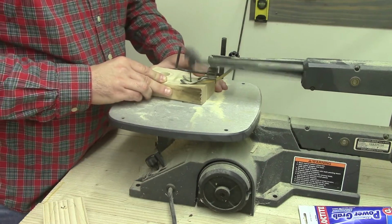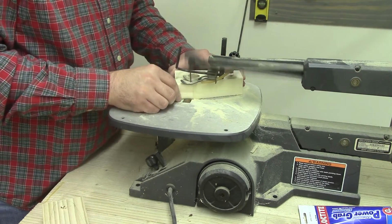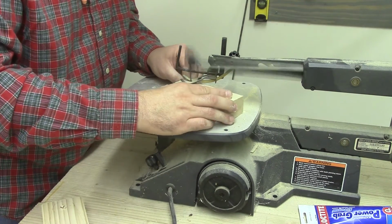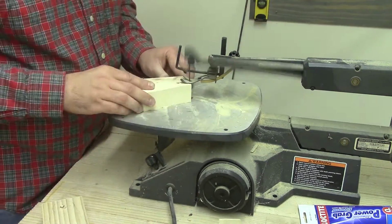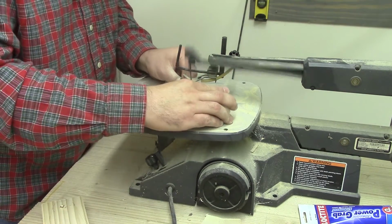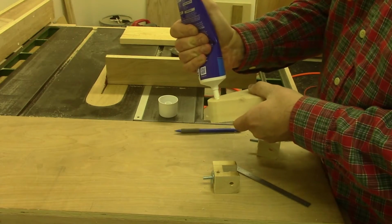This is the cam that I'm using in order to deploy the wheels. The distance between the two holes is equal to the length of the throw on the two legs. That'll give me a 60 degree throw with the arm on the side. If you want to design this project for different angles of throw, you'll simply have to do the math. 60 degrees will just give us a very simple equilateral triangle.